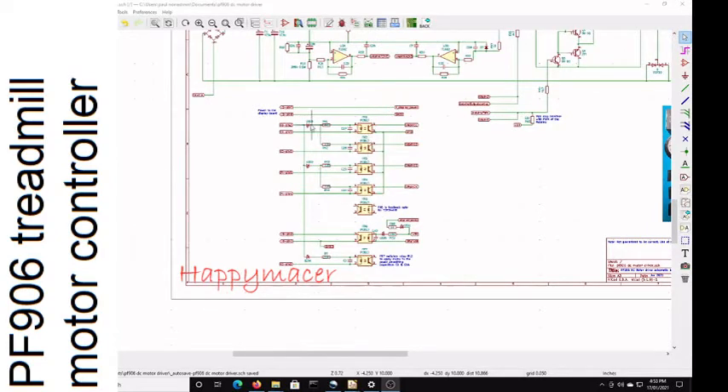FR1 and FR2 have LED3 associated and are just inputs to the PIC chip. LED2 is associated with FR3 and FR4 and drives two pins on the PIC chip. FR5 is the opto feedback for the switch mode power supply controller. FR6 is the feedback from the PIC chip back to the treadmill controller board — probably not of much use. LED1 and LED4 are of course associated with driving FR7 and the relay.